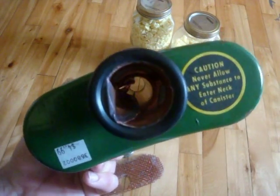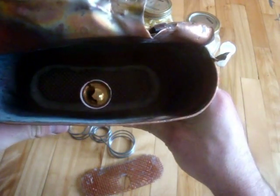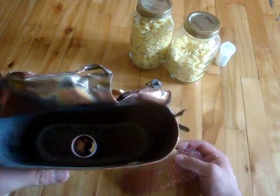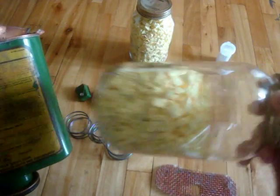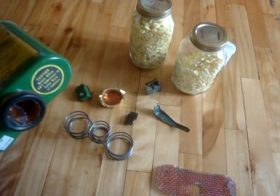You connect it into the equipment and it breaks the seal. You can see down there a tube down the center and an opening around the sides. Inside there's a little screen with material at the bottom — I think it's actually asbestos, but I can't be sure; I just know it doesn't burn, and it's from the right time period for it. Then filled up to just past the halfway point, you've got this material here, which is potassium superoxide or KO2. That's your scrubber and oxygen generator.